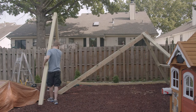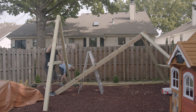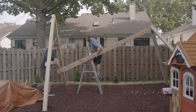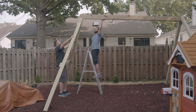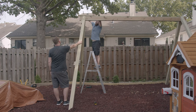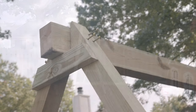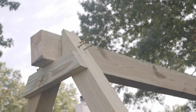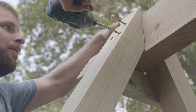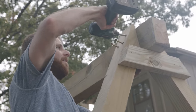We'll go ahead and use that same technique for the other side of the swing set. However, before we hoist the 4x6 up, we're going to want to measure and make sure that A-frame is in the correct position. Now you can hoist the 4x6 on a ladder and that will give you enough clearance to slide the 4x6 into the gap of the other side of the A-frame. Then you want to hammer it into position. Make sure that with both sides of the swing set, you're lining up the A-frame with the 5 degree mark that you made on the 4x6. Now we'll go ahead and fully secure the A-frame with the 4 inch lag screws.